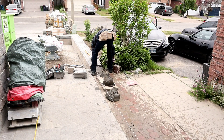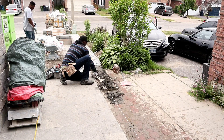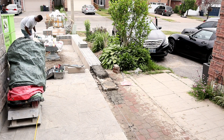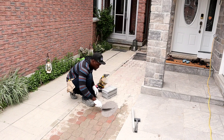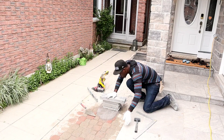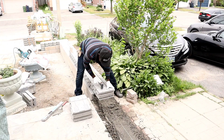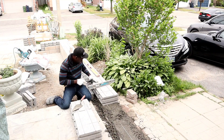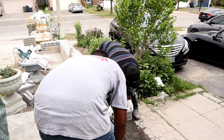Right here I'm putting some mortar to catch my level right on top of the interlock there. I'm laying the block on top of the mortar — I find it super easy. I wish I had used mortar down at the bottom for my first layer. The mortar works just the same as polymeric sand. I'm leveling this side and squaring it so I can use the line as a guide, just the same way I used the line for the first course. If you're planning on doing this and can afford some mortar instead of working on the sub base, I strongly recommend it.